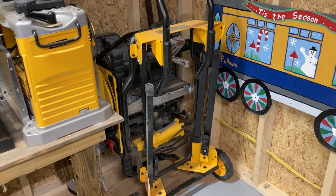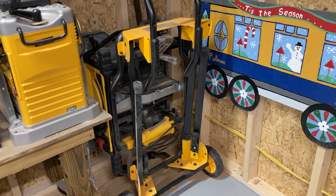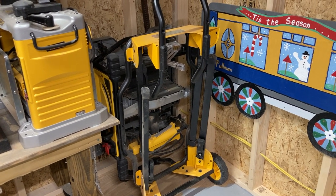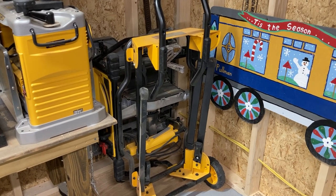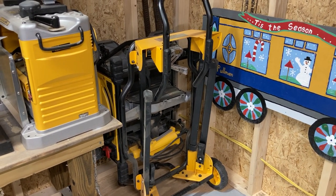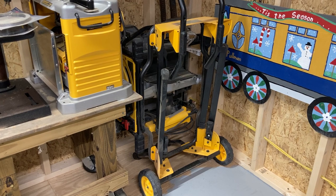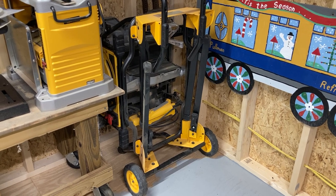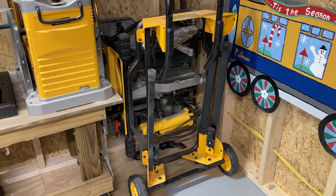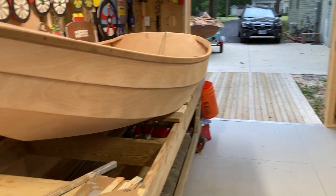What we wanted to do first was cut the gunnels — cut the little strip. We made it 3/8 inches wide, and in addition to the plank, that gave us a total of one inch. Could have gone a little thicker but we figured that would be plenty thick. Plus we had some super stout quarter knees. We cut that with our little DeWalt table saw on its stand — rolled it outside, set it up, marked the mahogany, and ripped 3/8-inch strips off of it.